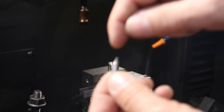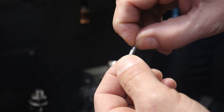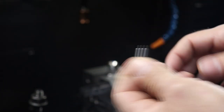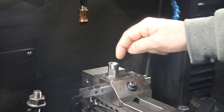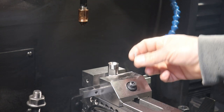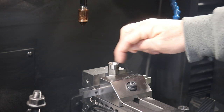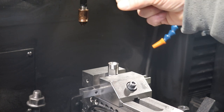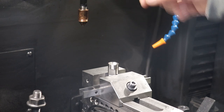a little disc onto the tip of the, or probably press fitting glue, a little disc onto the plunger, this 16th inch rod here. And then, so when the robot moves this punch with the piece of paper or plastic film inside of the cutter, the plunger that's underneath the film will push the disc that we cut off and place it onto the appropriate location on the plastic base that we're going to weld this plastic film onto.